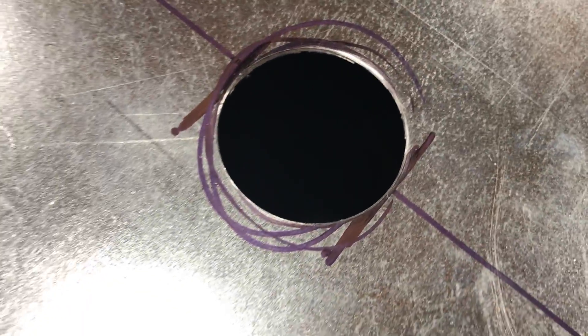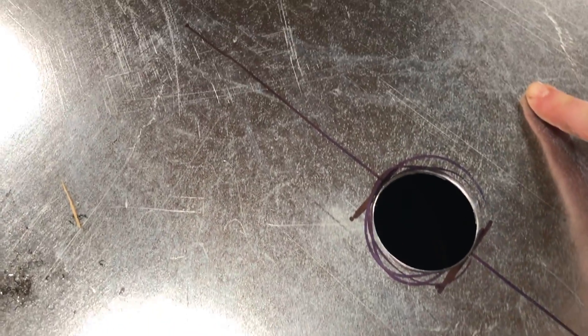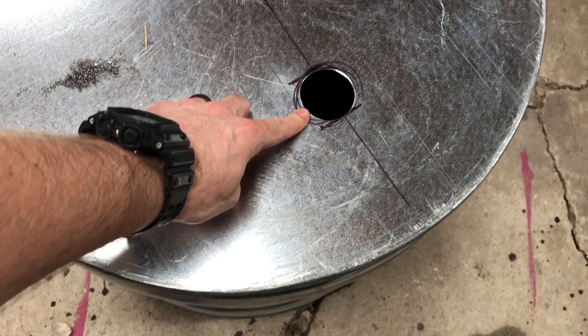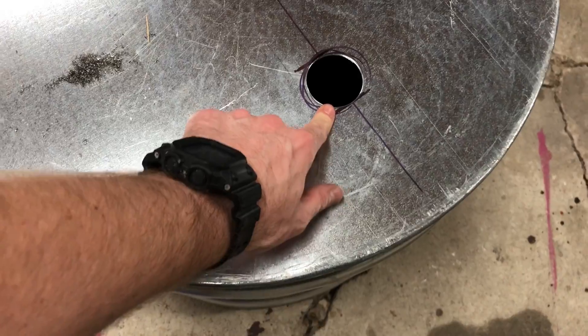There it goes. Those are little tiny shards of metal on the rag — that's what it throws out, which is another reason why I don't go crazy fast. You do not want that stuff getting on you. Nice clean edge on this — those hole saws work just fine. That's an old one, I believe it's the Aggressor by Blue Mole — I've had that thing for so long, I might have even got it from my dad. Now the next challenge is I need to bend this out a little bit so I can get the interior piece of the drain to sit down flush into this, so it drains better.